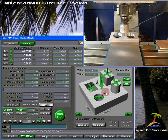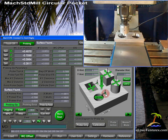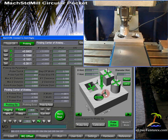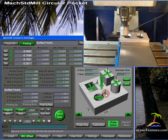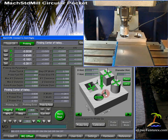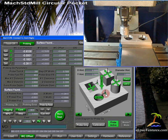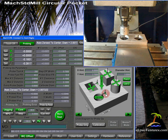You'll notice I'm just off of the pocket — not anywhere near the center, just some arbitrary place off the edge. Because the down-and-over operation comes down and then moves over in X-minus, I've picked a spot so that when I move over by the step-off distance, I'll be inside the circle when it goes down to probe depth. So we probe down, find the top surface, move over, come down to probe depth, find one surface of the pocket, then along the X-axis find a second surface. It then finds the centerline, probes in Y-plus, comes back, probes in Y-minus, takes us to the preliminary center, and re-probes in X. That second X-direction probe removes cosine error from not being on the centerline during the first set of X-direction probes. We've now left ourselves at the center of the circular pocket — one button finds it.